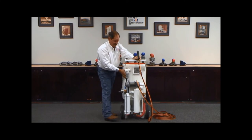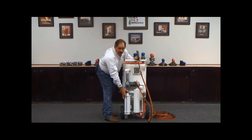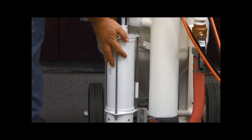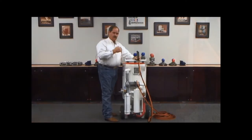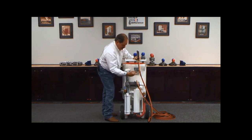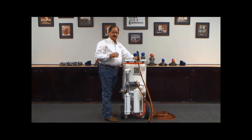And opening the pinch on this blowdown hose, allowing the energy — the air — from the vessel to exhaust to atmosphere through our VBS system. It reduces the noise and the intensity of the energy as it exits this vessel. Once your dead man has allowed your combo valve to go back to rest, all of the energy from your vessel exhausts through atmosphere through the VBS, and your blast operation stops.